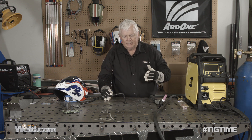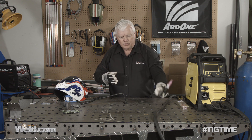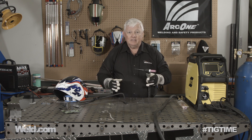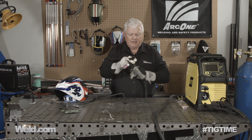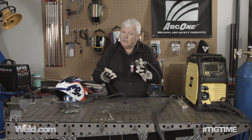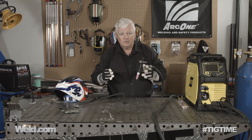One of the things we talked about is how far do you go with this machine? I'm going to show you some clusters that you would weld if you're in the bicycle industry or racing industry. And this torch is absolutely not the torch you would want. I did a pretty good job in flat 1G position because I could rest my elbow and slide. But when you get into out-of-position work, this is not a good torch to have. So I'm going to go ahead and change this out and show you some of the tricks of the trade and what you can do with this.